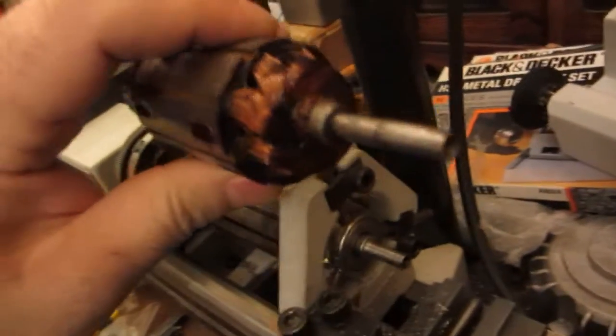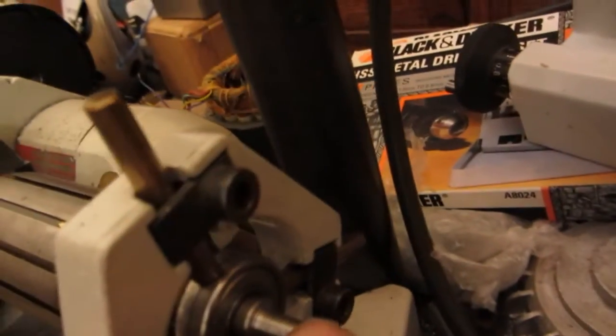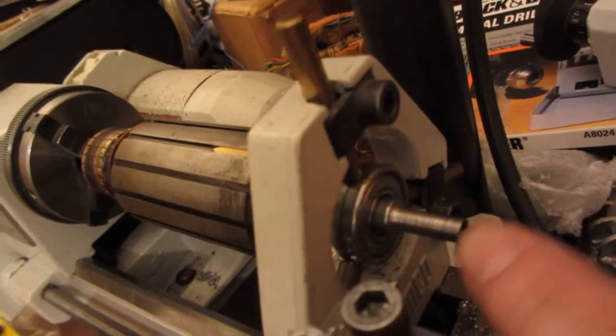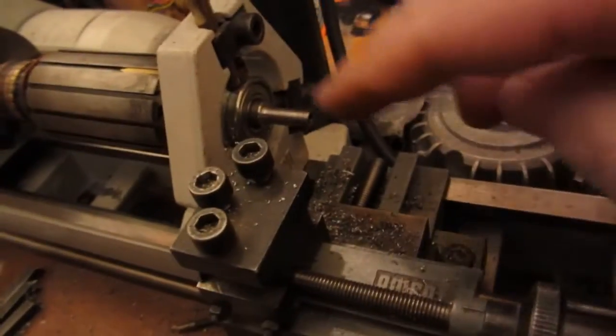Now there's this motor shaft which is good apart from the fact that the armature windings are bad. So I've made another shaft which is exactly the same, although on a bigger bearing. The reason I had to use the bigger bearing is because I had to drill this piece of metal — 10 millimeters diameter rod — through to just shy of six millimeters so it can be a very tight interference fit, pressed together with the press.